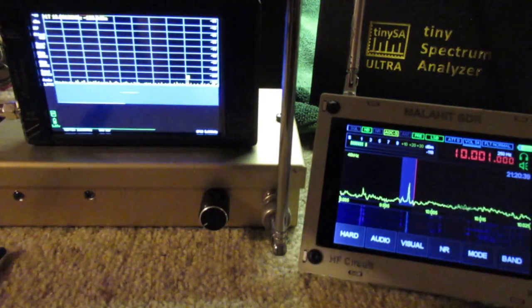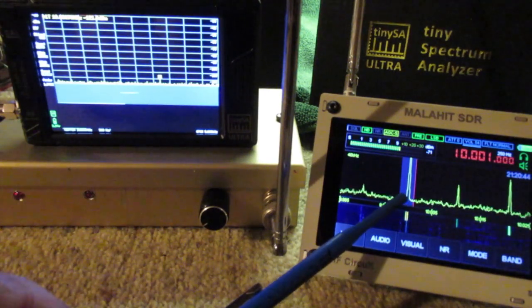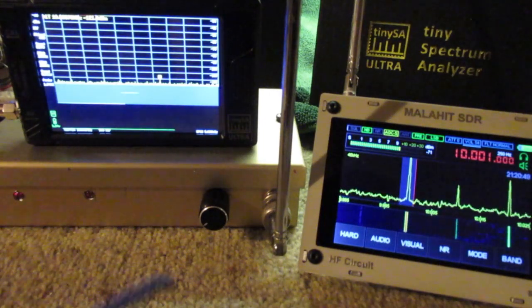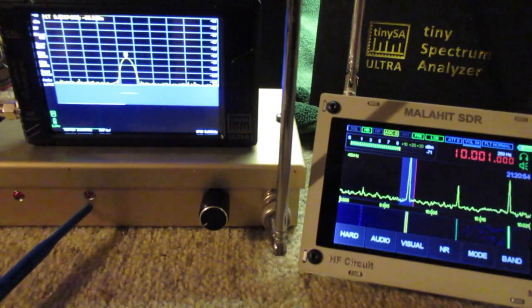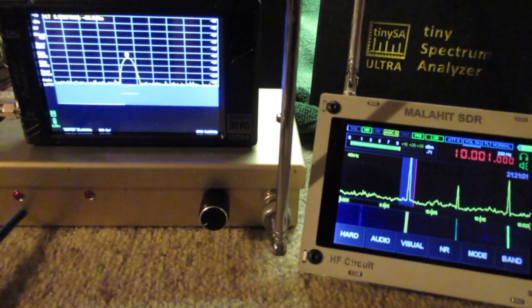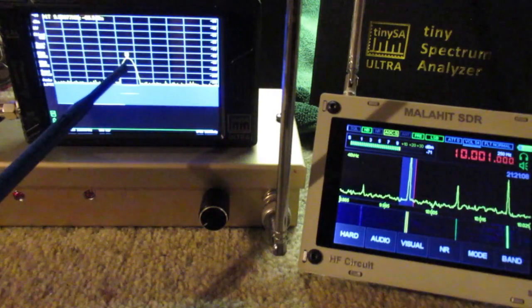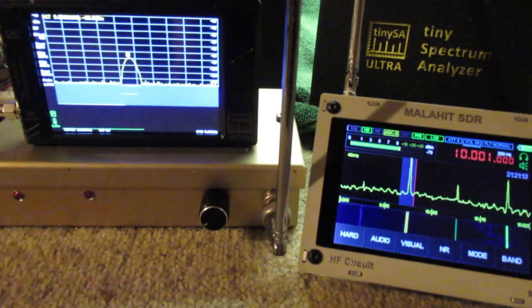So here we go. We switch on the GPSDO. You can see it's not exactly on frequency, but it's somewhere there, and you can hear it drifting away. The blinking green LED indicates that the GPS is working, but it's not locked. It's waiting for the blue LED from the GPS to produce a 1 pulse per second. You can see that it's appeared on the screen slightly to the left. So we'll just let everything warm up.